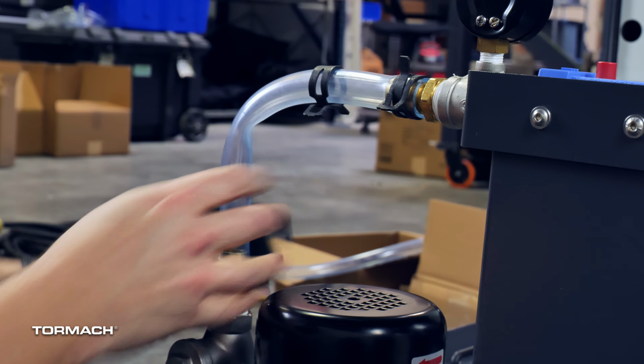Find the swiveling coolant nozzles and the coolant ring that are included in the kit. Install each nozzle into the coolant ring with a 17mm wrench. Tighten the nozzles until they're pointed towards the center of the ring. The first few 1500 MX coolant rings will have plugs that go into these locations.